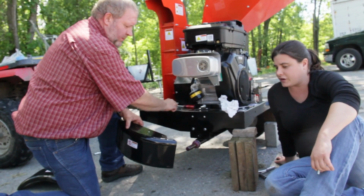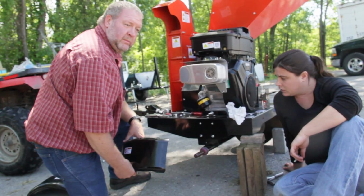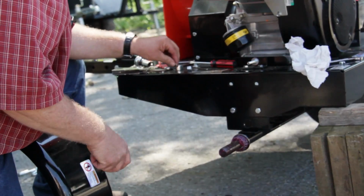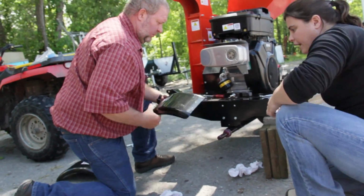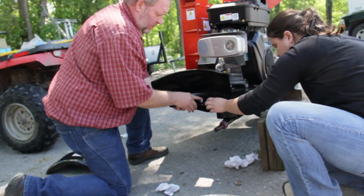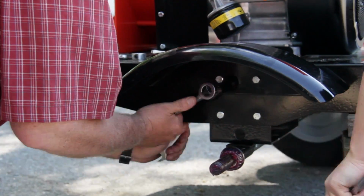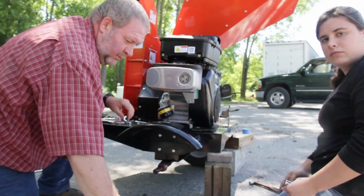You're going to put on the fender. Make sure you do that before you install the wheel on the axle. There are 2 bolts here and here that come pre-installed. Make sure you just unscrew those using 9/16, like you did for the axle below, and you put it on. There you go. We installed it.